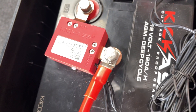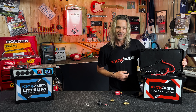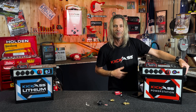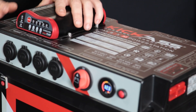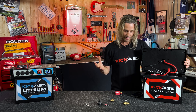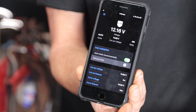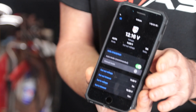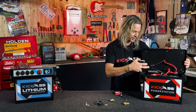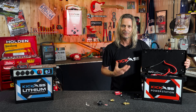Let's have a quick look at how I've got the battery guard set up in this application. I'm using it as a low voltage disconnect. I've already got a DC-DC charger, so this already has a built-in VSR. The benefit of this unit is it's going to protect my batteries at a set voltage. I've got this one set at 11 volts — you can see on my phone here. So if I've got a fridge or some load drawing on this battery, once it gets to 11 volts, the battery guard is going to cut out and protect the battery from being further discharged.